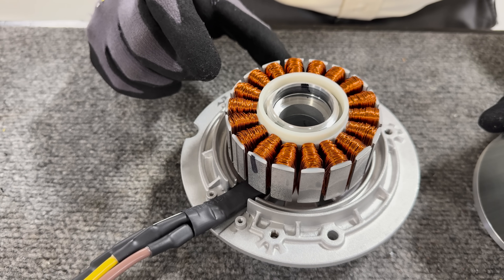It's very fast. It was developed originally for winding brush DC motors, and now it's used for winding these inside-out brushless DC motors. The reason why it's brushless is that you don't need to use brushes to change the current, because we plug this into an inverter and the inverter does the job of switching the current from one direction to the other.